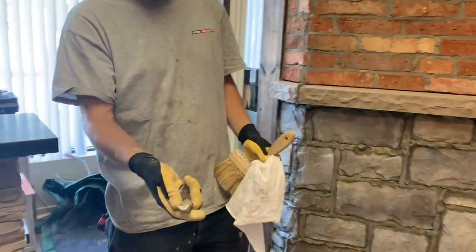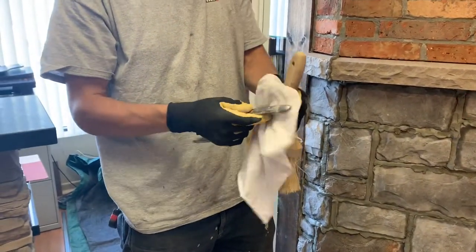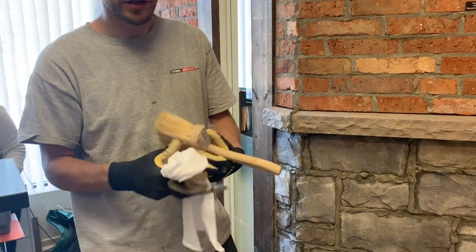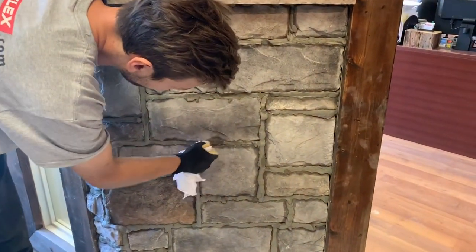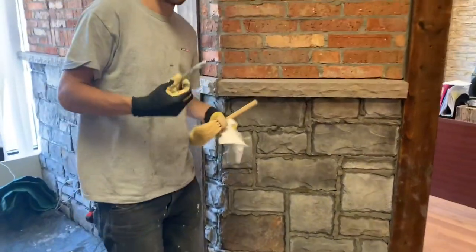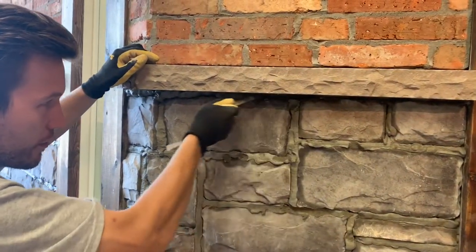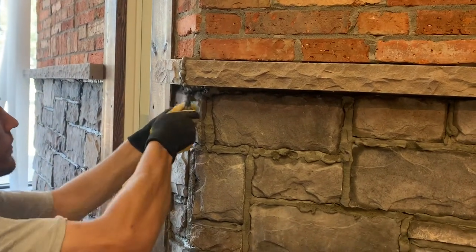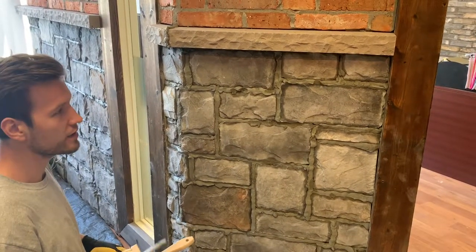The three tools you're going to need: the grouting tool — you can also just use a rounded stick or even your finger, but we recommend the grouting tool because it has a nice groove and shape to get the grout just right. You're also going to want a brush for after you clean up the grout with the tool. And just in case you made a few mistakes, a clean rag to clean up some edges. You can just run along your dry grout with the tool, drawing it towards you — not pushing it. Do the entire grout first with the tool before moving on to the brush, since the brush usually needs the grout to be a little bit drier.